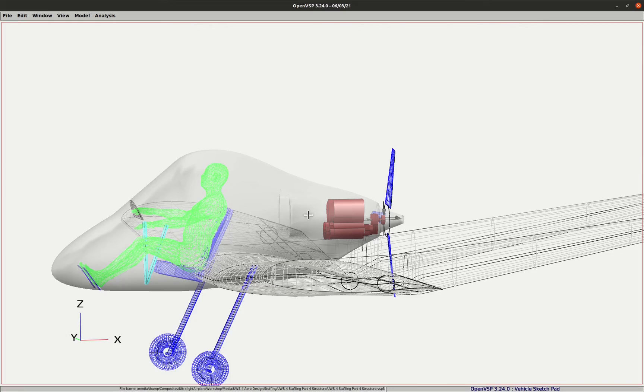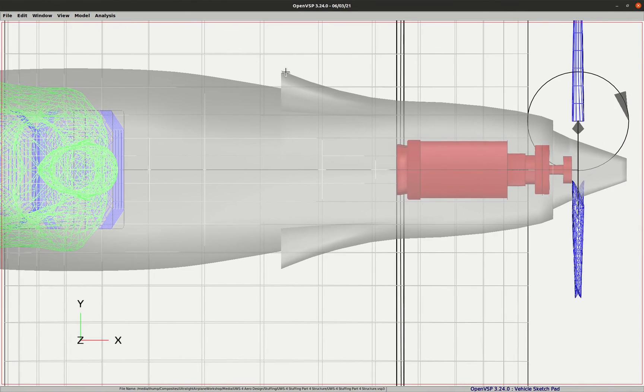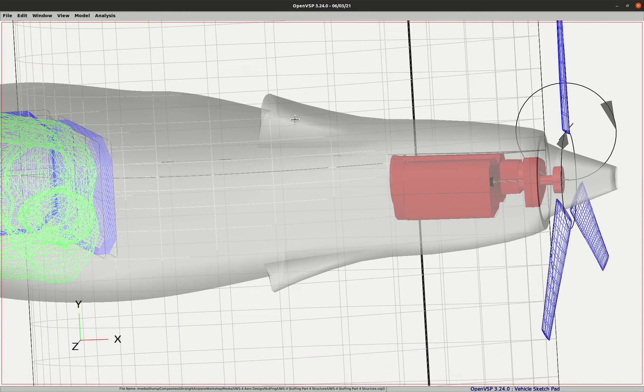I could move the firewall a little farther aft, which would make it shorter, narrower, and save some weight. But looking at the top view, moving the firewall and scoops farther aft means the inlet air has to make a sharper turn to reach the engine fan. The engine model — a Cuyuna UL-2 — has a fan that blows air through the cylinder heads. Right now there's a fairly simple, straight shot into where that fan is. Moving the scoops back creates a tighter turn, increasing drag. So there's a trade-off between drag and weight — something we encounter frequently on this airplane.